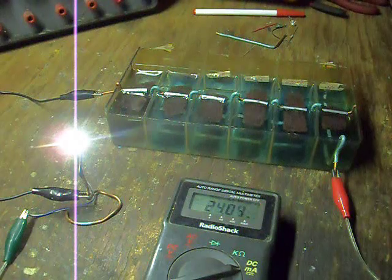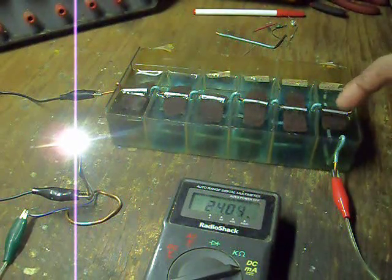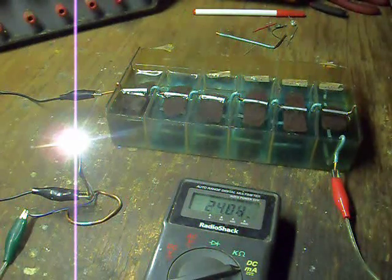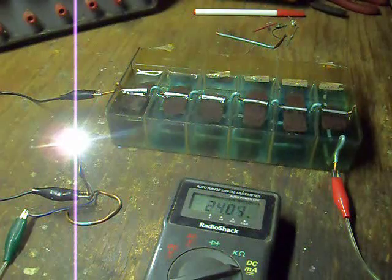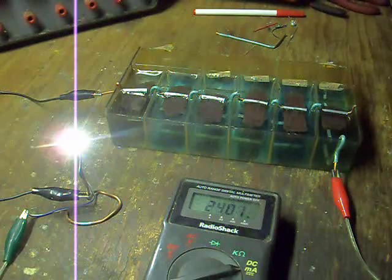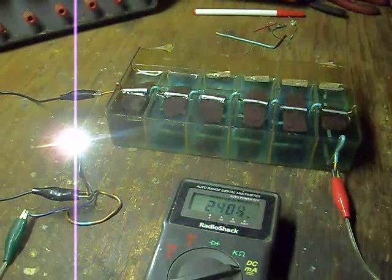At 36 hours after commissioning of the battery, the current has started to fall off, down to 24 milliamps, and the zinc is starting to show signs of being in the last stages of being fully consumed. This battery is on the last stages of its life. The peak current during operational time was around 40 to 41 milliamps, now dropping off to about 24 milliamps.